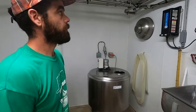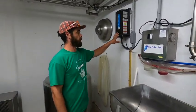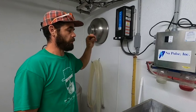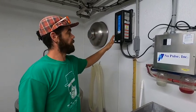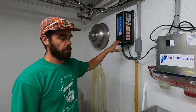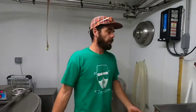So you're talking about electronic pulsation versus vacuum. Electronic pulsation is this box controlling the pulsation rate, how many pulses per second or whatever it is. And it's set different between cows and goats. Vacuum pulsation is what you see on top of an old milk bucket. I actually don't have a lid in here right now to show you.